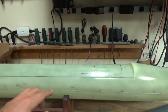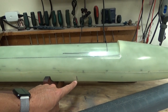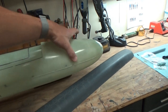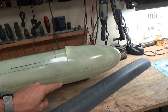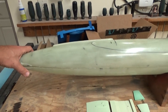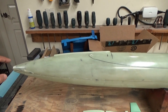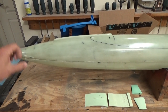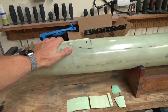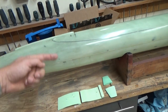Our front section would be about 51.5 inches long. Doing the split up here at the front will give us roughly equal length of lower hull as well. The challenge is we've got a huge area that would all be enclosed like a tube once you adhere the upper and lower hulls together. The solution is to actually make three sections — we'll do a cut here for easy access to the rear control linkages, that section will be separate and removable, and the final cut will be right here where the upper hull mates to the lower hull assembly.